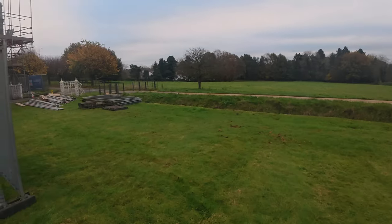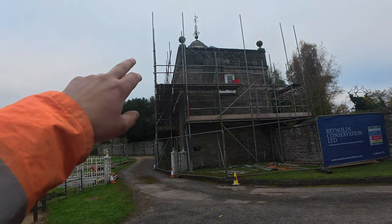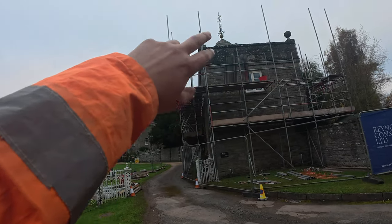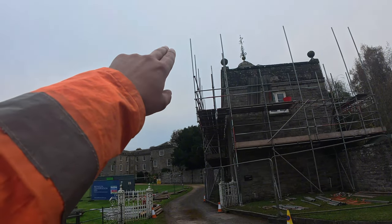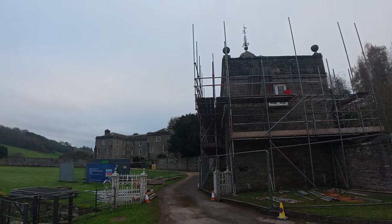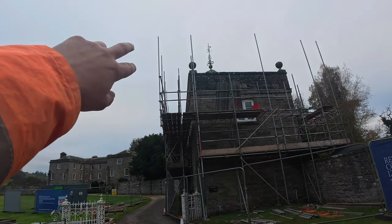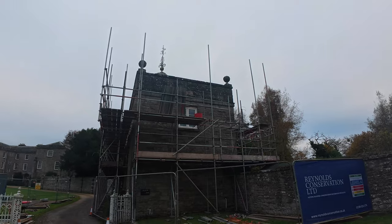This corner on them beams is a bit bouncy, because obviously we've come down that side. So what I'm going to do is run a six metre beam in through that lift — there's a lift height to pick up that corner and take some of the weight. I'll just put one beam in on the outside because it's not majorly bouncy, just a tiny bit. So yeah, we're going to run a six metre beam straight through, all the way across to that side, and then across to that leg — hopefully that'll take some of the bounce out.